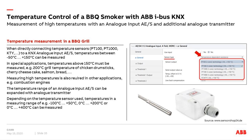In principle, we need a so-called analog transmitter. I bought this device from a German company, SensorShop24DE — it should also be available in your country. With this device, we can expand the temperature range of an analog input. Depending on the analog transmitter and the connected temperature sensor, we can expand the temperature range — for example, between minus 100 and plus 50 degrees, from 0 to 200 degrees, or from 0 to 400 degrees. I used the 0 to 400 degrees range in my barbecue grill, because sometimes I have 250 or 300 degrees. This is the best range for a barbecue grill.